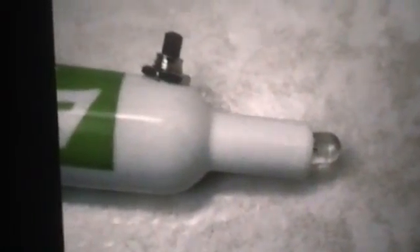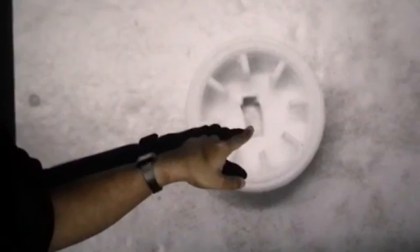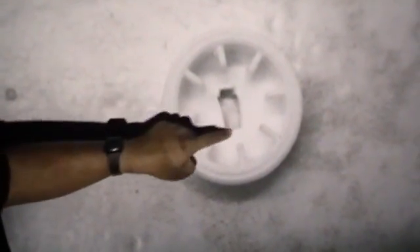The reason the LED is a little off angle is because the capacitor is just about there — not a big issue. Next, on the back of the pen, slice a little hole. I used a telephone cable because that's what I had available and it was nice and flat, and for aesthetic reasons it didn't look too bad. I simply cut a little bit out that was just the right size for the cable. Slip the cable through with some more heat-shrink tubing here, and that's going to be our strain relief.